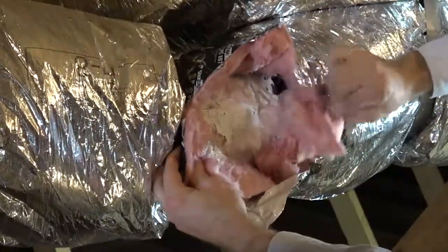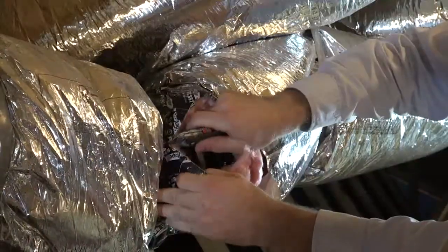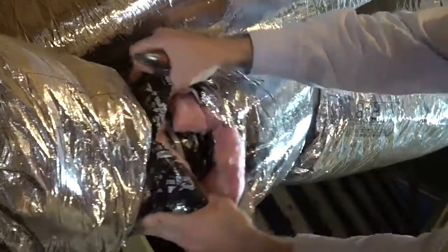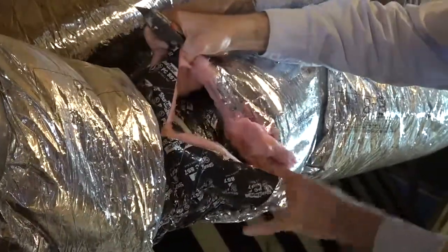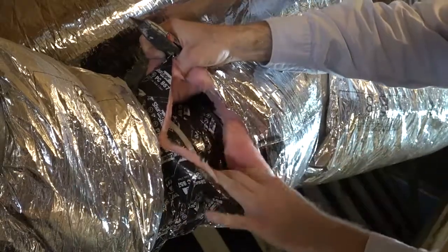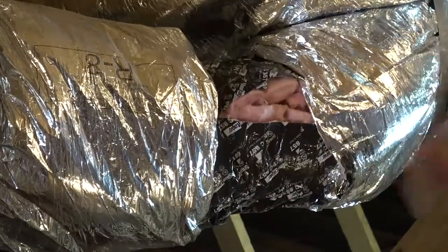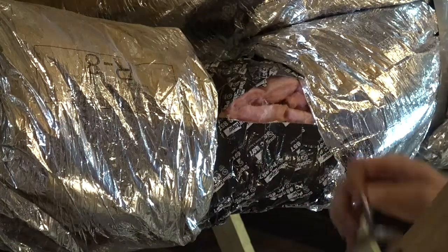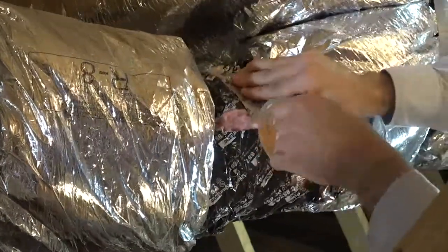Check the connections on both sides all the way around the rigid metal splice. If you find joints or connections that have not been sealed, you can leave those spots exposed for easy access for repair and let the HVAC contractor put the insulation layer back together after duct sealing has been completed. If you confirm that all the connections between the flex duct and splice have been sealed with bucket mastic, then you can put the insulation layer back together as you found it with either tape or mastic.